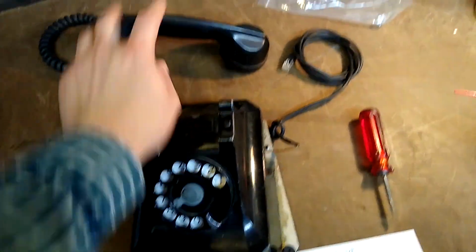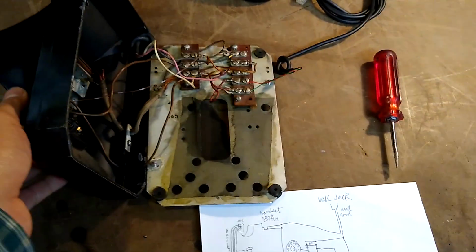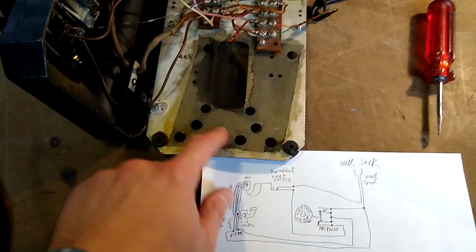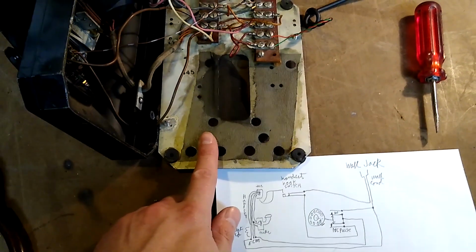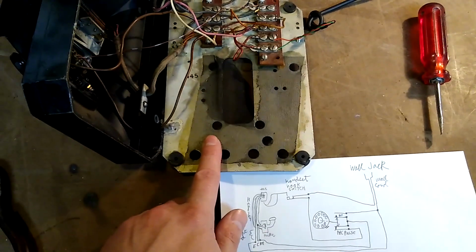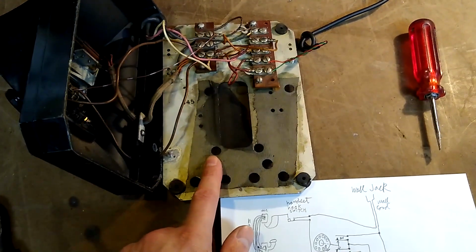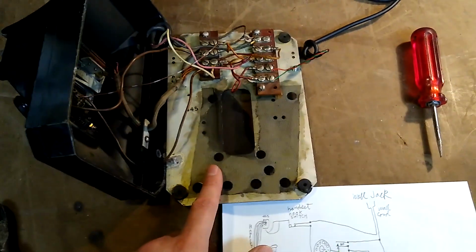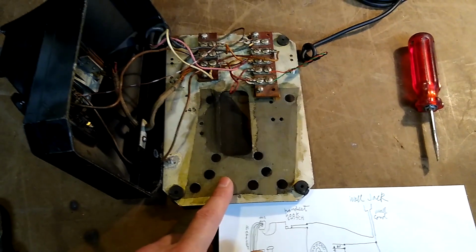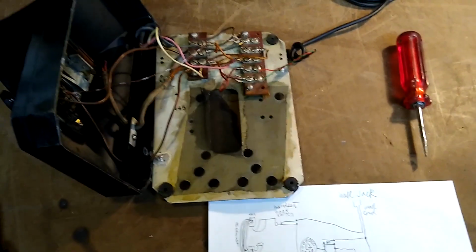As long as you have the components this phone has, a hook switch, a dial, and a handset, you can make an operational phone. Some old-timers may criticize me for not having the transformer. It probably is useful for impedance matching when you have twisted pair phone service with a normal landline that doesn't go through a modem, but I haven't had one of those in many, many years, and I found that it isn't essential in my case to have the matching transformer.